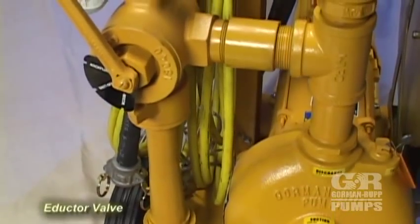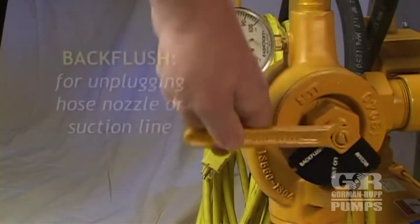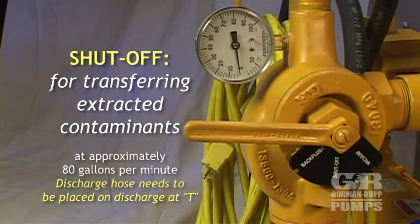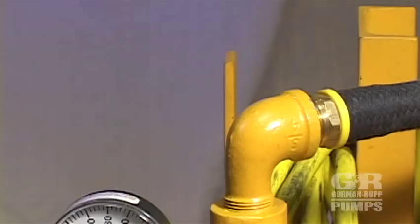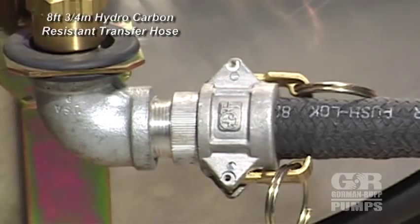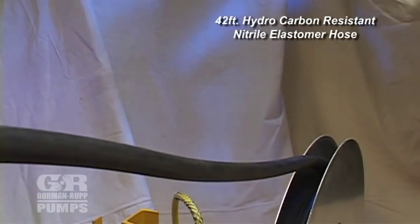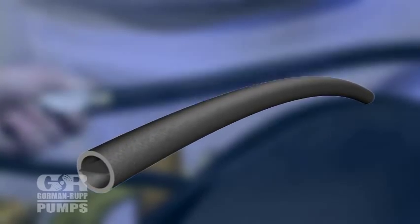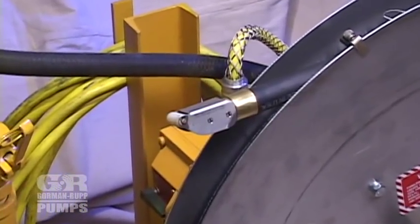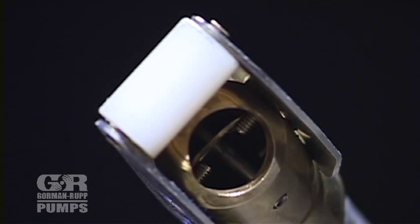Connected to the discharge side of the pump is the eductor valve, which can be placed in one of three positions: vacuum mode for cleaning, backflush mode for unplugging the hose nozzle or suction line, and shut-off mode for transferring extracted contaminants at approximately 80 gallons a minute. Running from the top of the eductor valve to the reel assembly is 8 feet of 3/4-inch hydrocarbon-resistant transfer hose with a quick-release coupler. Contained in the reel assembly is 42 feet of 5/8-inch diameter hydrocarbon-resistant nitroelastomer hose. Inside the hose is a special internal spring steel strip for lateral stiffness and longitudinal flexibility. At the end of this hose is an exclusive roller guard and nozzle assembly designed to allow the hose to traverse the bottom of the buried tank without lifting or losing contact with the settled contaminant.